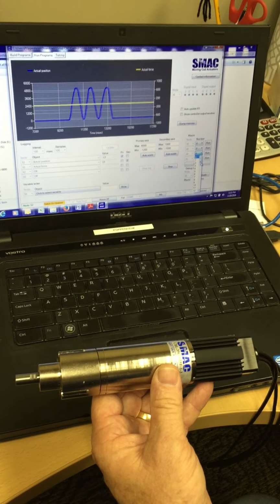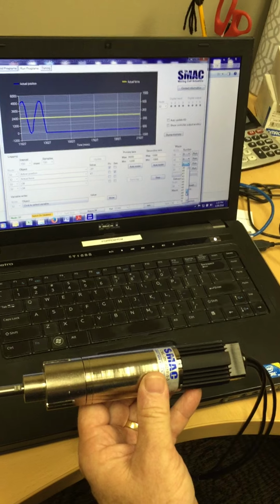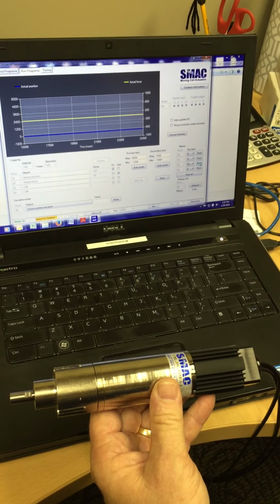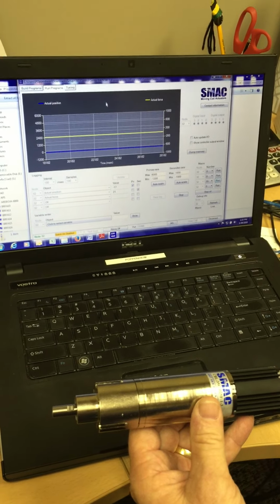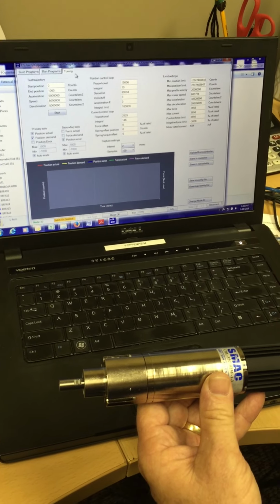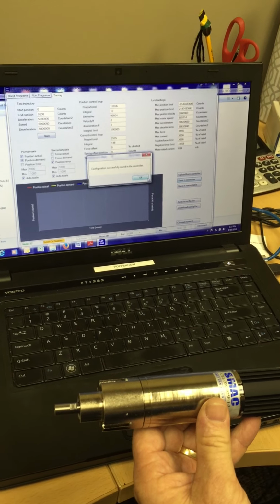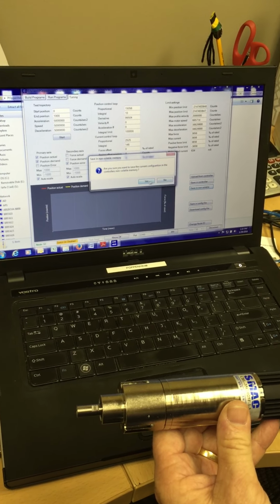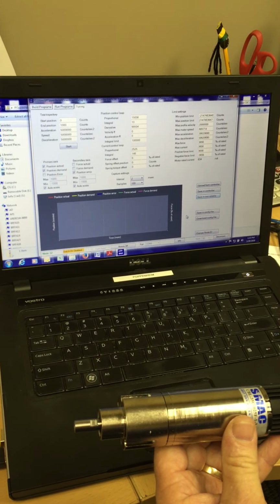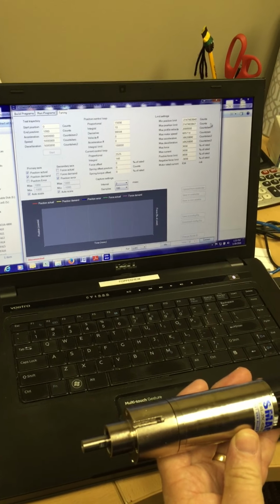To activate the new base program, you run macro 55. After you run macro 55, you then go over to the tuning tab, hit save in controller, and save to non-volatile. Once that's completed, you can now disconnect, and you're now finished with this part of downloading the base program.